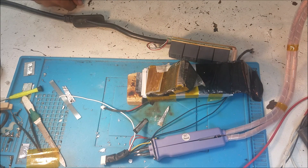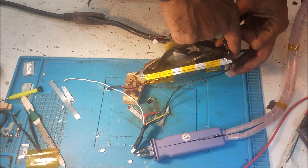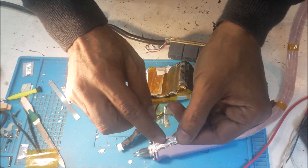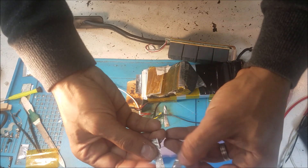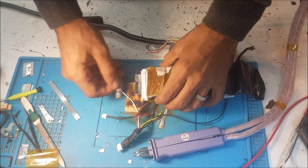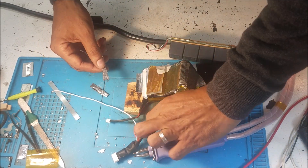These flat batteries have one side that is copper-nickel and the other side is aluminum. With the copper plate I can solder fine on it. But when I was trying to put the battery together, the aluminum pieces start cracking because it's easy to crack. When I try to solder it, the solder doesn't stick to the aluminum - that's normal.